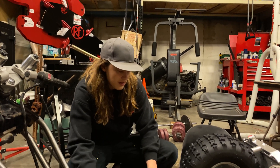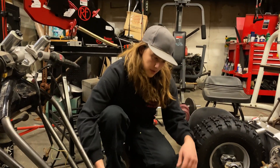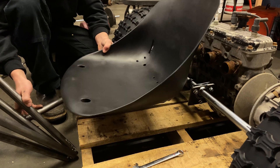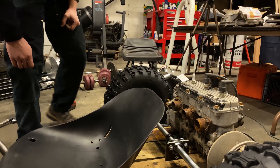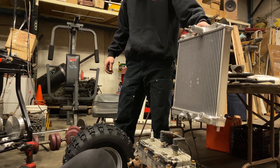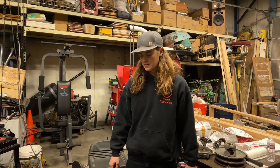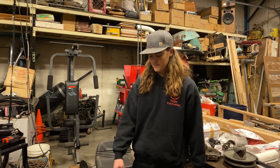Alright, so we're getting started building these lower frame rails. The plan is we'll have one on each outside bearing, that'll be the same side to side, and then there will be two more inside bearings that'll come off these upper tubes and run back at an angle — it'll also double as areas to mount the seat. The seat will be kind of right about there, motor back here with a mess of pipes coming out of it, and the radiator somewhere in this general region — still kind of got to figure that out as we build. I'm going to have to notch these with a grinder because I forgot to buy the hole saw and arbor until last night, so those first tubes we're going to get hand notched.